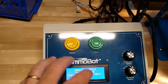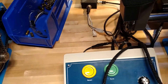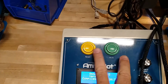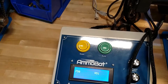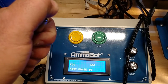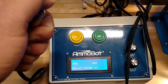This is a cool mode and it only works for the D-boss, so don't think it'll work for anything else. Come over to the control box — this happens to be a rev3, but this also works on the rev2. The first thing you do is get your stop switch in hand, then press the green and the yellow buttons at the same time. Let the yellow one off and then the green comes up. Now you're in test mode, and every time you hit the stop switch you will see the numbers: case range, bullet range, case range, bullet range.